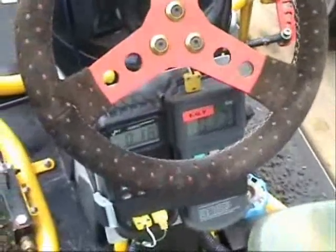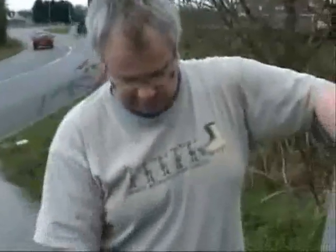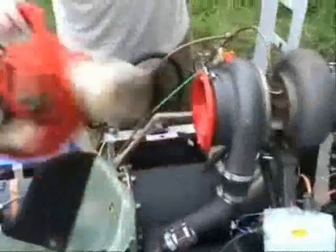I'll explain the principle of a jet engine. You start this particular type of jet engine — because it hasn't got electric start or air impingement start, where you fire compressed air at the turbine blades to spin them up — this one works on forced air start. You use this little thing running, which forces air into there. High tech garden blower. Does the job.